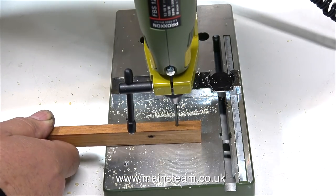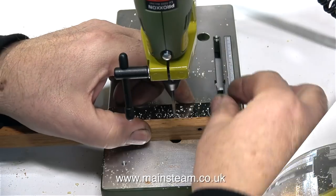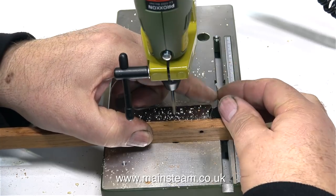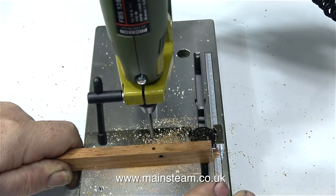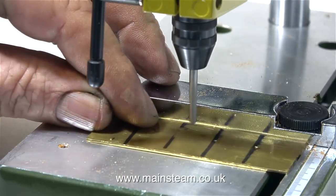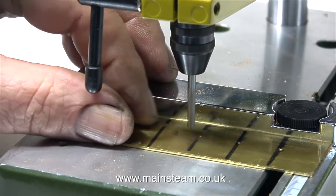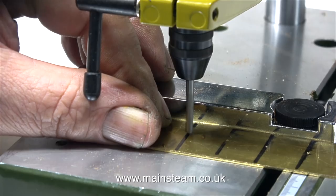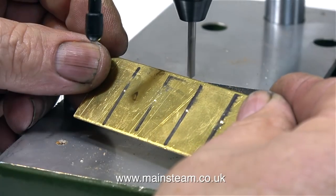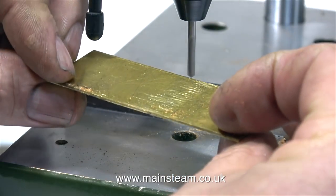In this clip I'm drilling a piece of mahogany, and this 1/8th inch drill bit goes through the mahogany with ease. A good feature of this drill press is the adjustable guide, which will really help when it comes to drilling holes in a line. As a test, I roughly marked out a piece of brass, then used a short spotting drill in the chuck to make small conical depressions in the top of the brass. I could drill all the way through, or they could just act as guides for a much larger drill bit in my main drilling machine.